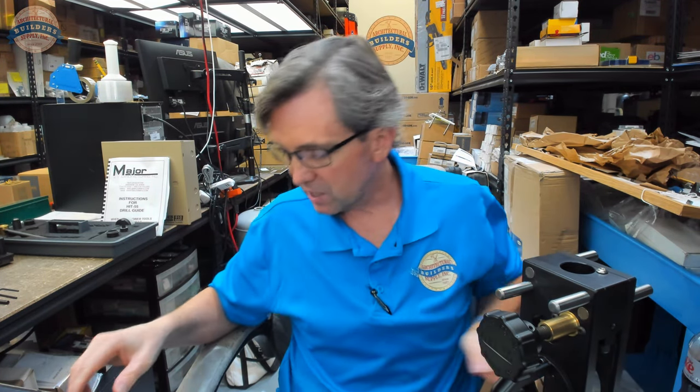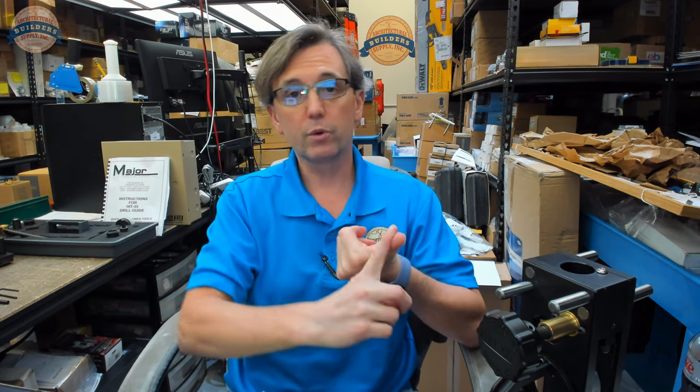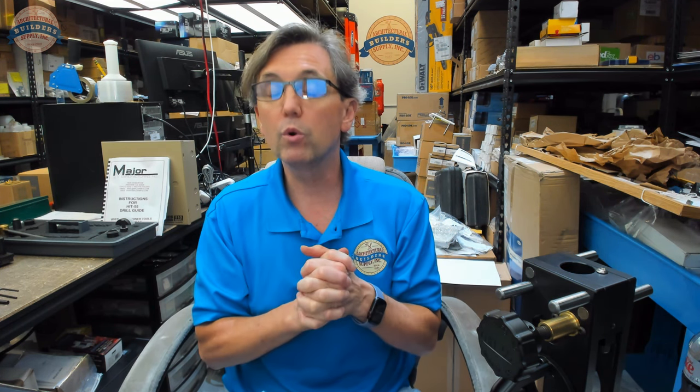There are locks that take a 1.5 inch hole. Schlage has deadbolts that will take a 1.5 inch hole. Their current B60, I think, will go into a 1.5 inch hole. The B100, which is discontinued. The B400, which is discontinued. The B250, which is not discontinued. All of those would, or do, go into a 1.5 inch hole.